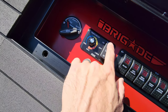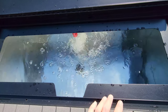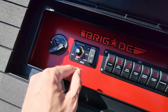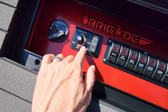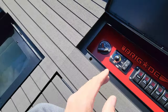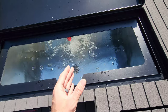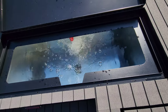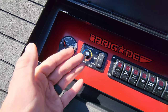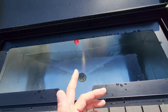If we want to recirculate the livewell, just put it on recirculate — straight run — and all that's doing is pulling water out of the screen drain, back to the pump, and pumping it back through. For the variable timer, again one minute off up to 12 minutes off: select your time and hit timer. It runs for that first interval, automatically times out, goes off, then kicks on and off throughout the day. You can change that from one minute to 12 minutes off.